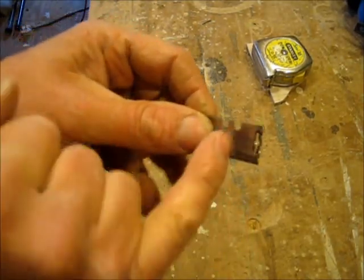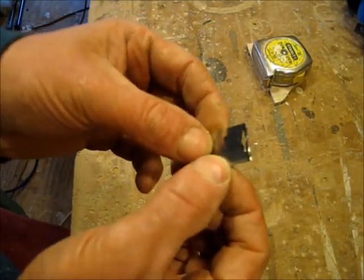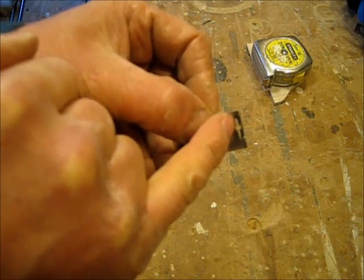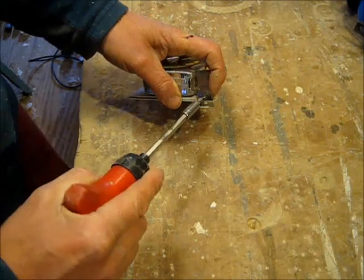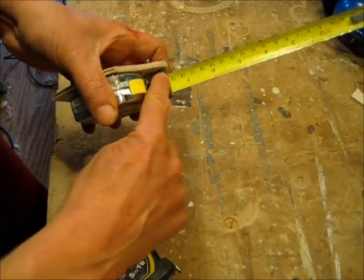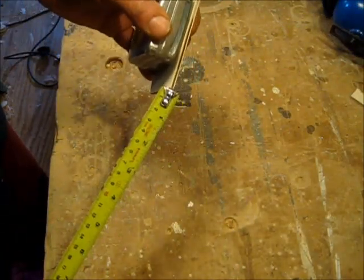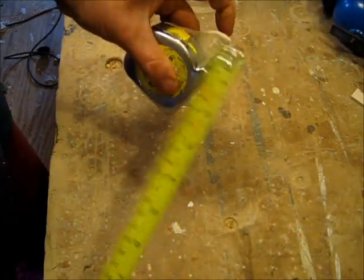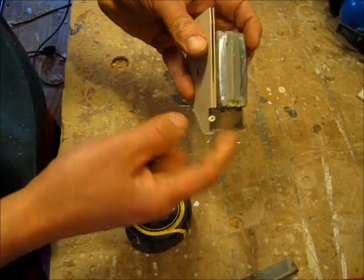Found it was nearly impossible to drill a hole through this hardened steel cutting blade. Cutting a small slot allowed me to get enough cut with my drill through. So that's done. We can pull it out and read our measurement from here to work out the distance from the top of the blade to the bottom, then take that off of the tape. We've got 100mm between the top of there and there.